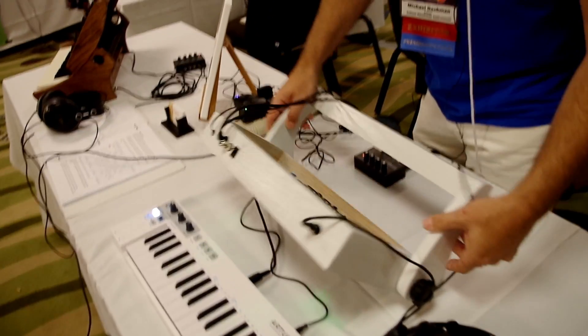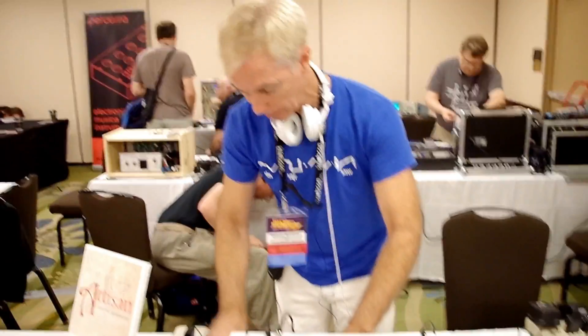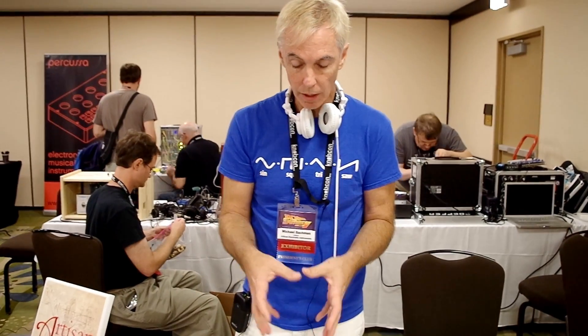The board behind that is the control board. One of the things this allows me to do in the future is to customize pretty quickly, because the voice card is stackable and the control card is separate. I'm working on a 5-voice, 5-octave polyphonic which will have a 32-inch wide cover, 35 knobs in the effects section, 25 switches, and a bigger OLED display — but it still talks the same way to the voice card.